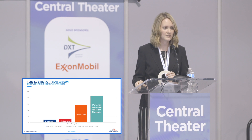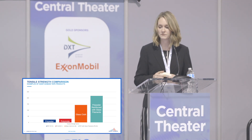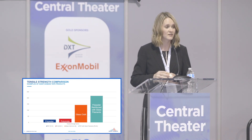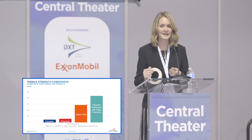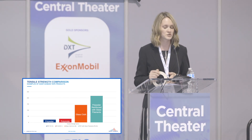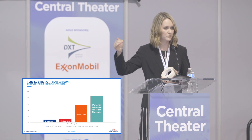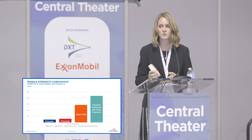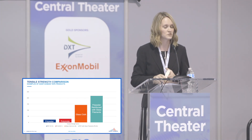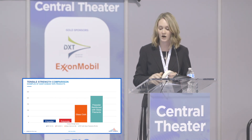Comparing the same four products for tensile strength: films like polyester and polyimide are more stretchy — they have high elongation and low tensile strength. A glass cloth will improve your tensile strength, but even more so, glass filaments added to a polyester will give you some of the most superior tensile strength products at a very competitive cost.